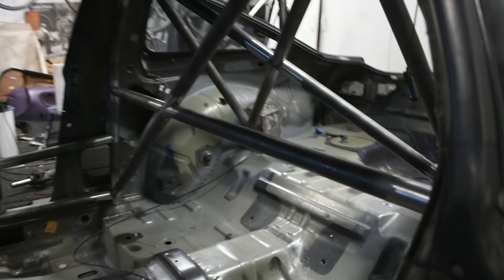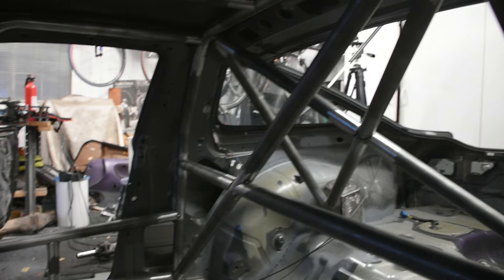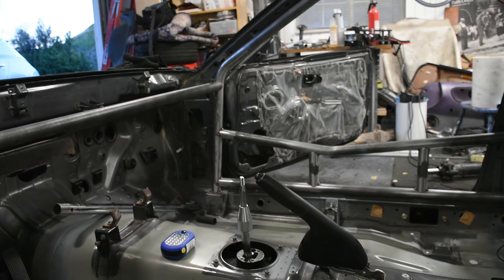In this episode I'm going to be welding the cage. The first thing I'm going to do is weld as many of the joints as I possibly can on the cage while it's still tacked to the base plates. Here's the cage right now. I'm going to start welding everything together because it's all mocked up, and I'm going to have to drop the cage and remove the base plates to drop it down to weld around the tops. In the meantime I'm going to weld everything I possibly can so that the cage has as much structure and integrity as possible, so that when I break the base plates nothing just folds in on it.